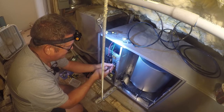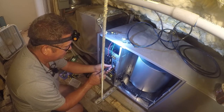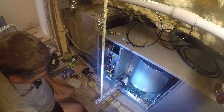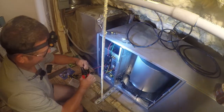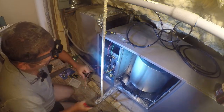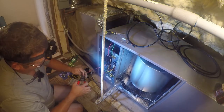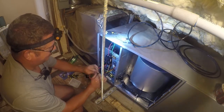And again, I'm just shocked. These are little tiny terminals for mains voltage, and they look like low voltage terminals to me. I'm sure they can handle high voltage, but they just don't look like they've got enough oomph. Absent additional overcurrent protection, everything has to be rated for 30 amps. That's the way it works.